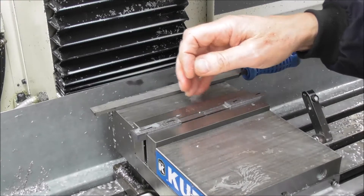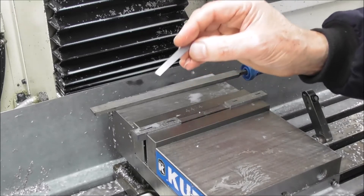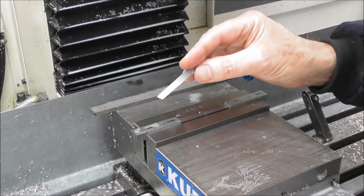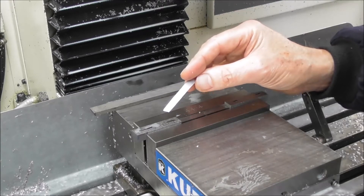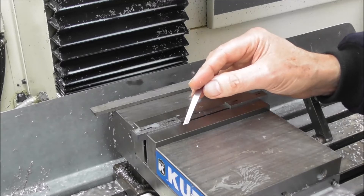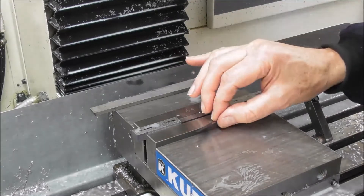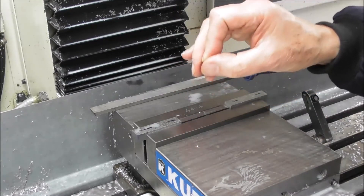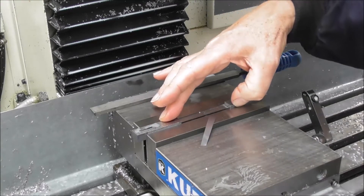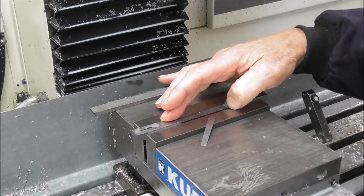It's amazing how often this will find a fault - honestly, almost 50% of the time this gauge finds a tiny little bit of chip or dust under the part which is holding it up or holding it out lengthways. I know I have to clean further and deburr until I get the feeler gauge unable to go in. Then your part is seated, you can tighten it up fully. It takes a few seconds each time, and if you're doing precision parts you won't get the rejects by using that method.